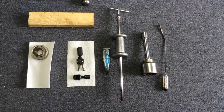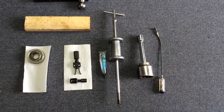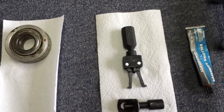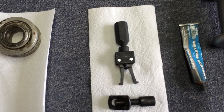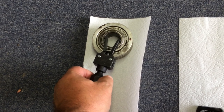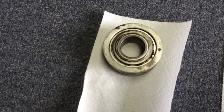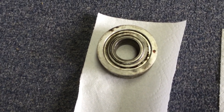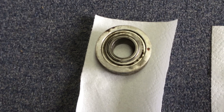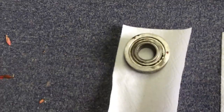It is beyond shot. You need to go to the auto parts store and rent one of these hammer-type slider devices. You're also going to need something to pull the bearing out with. My first attempt from AutoZone was a pilot bearing remover tool used for clutches and pilot bearings. The problem is it doesn't go around the bearing enough to pull it out. Also, what I did not know — and many boat mechanics are probably laughing right now — is that the bearing swivels inside the race. As I was pulling it out, my bearing was swiveling all around and I thought it was a complete disaster.